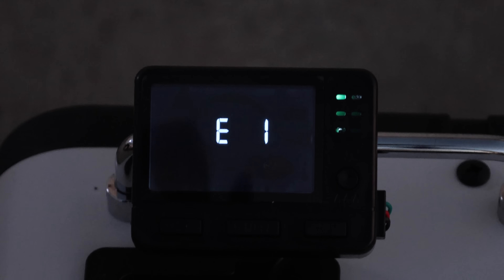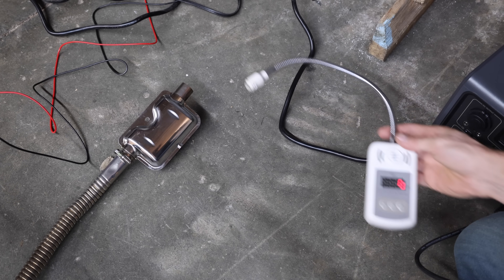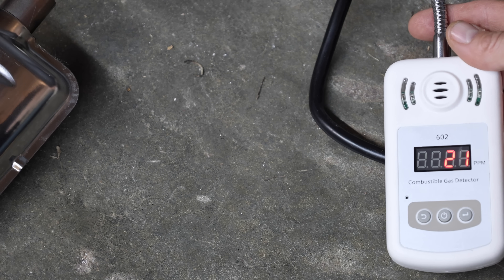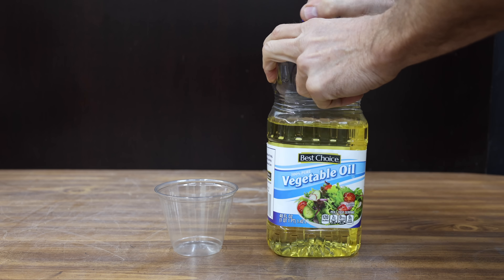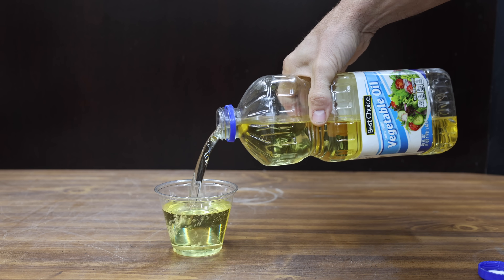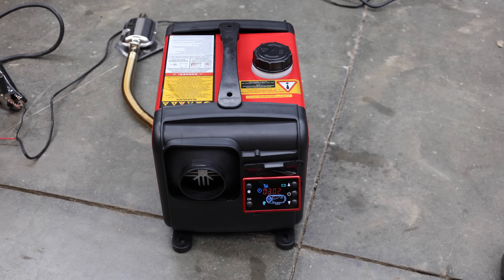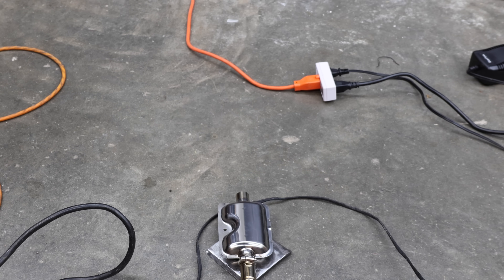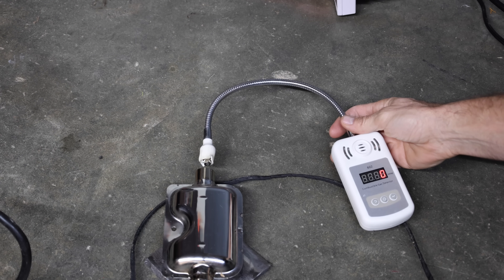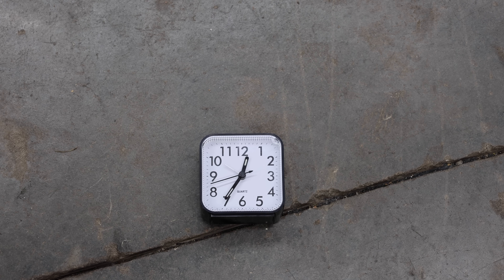Let's try running the Civil on some alternative fuels, but first let's measure how clean the Civil burns on straight diesel. The Civil is actually burning pretty clean at less than 100 parts per million. I ran the Civil completely out of fuel so we can test alternative fuels. If there's a power outage during a blizzard and you can't find diesel, could you use some vegetable oil? This probably won't work if the vegetable oil is super cold since viscosity may become an issue. Let's add just one cup of vegetable oil. The fuel pump is pumping — a good sign — and here comes the French-fry smoke from the exhaust. The Civil is powered up and making heat; once fully warmed up there's no more visible smoke. The vegetable oil is actually burning very clean and the tester is not finding any unburned combustible gases. The Civil ran for about 35 minutes on one cup of vegetable oil, which seems pretty good.